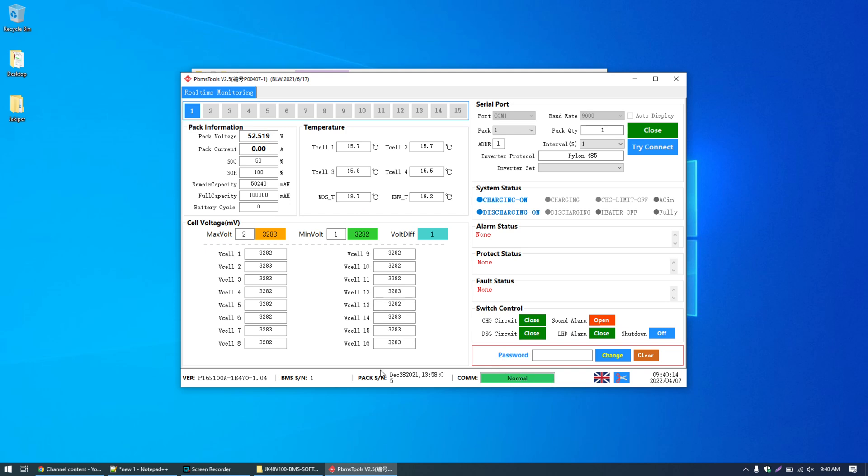You can see down here it is downloading information. We can see all the cell voltage information here on the left. The important part we need to look at is the top right where it says inverter protocol. Take this drop-down menu — when I found this battery yesterday, it was set to Pylon CAN, which is for the DEYE inverter and also the setting you'll need for the solar converter. However, we need to change this to Pylon 485. Click that and you'll see it says operation successful. We can see inverter protocol now says Pylon 485. The original software version 2.0 does not have this feature, which is what caught me up. Simply click close.